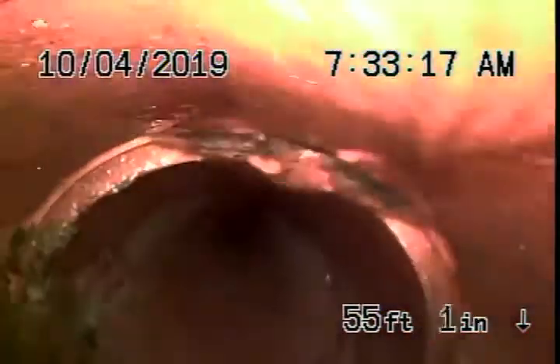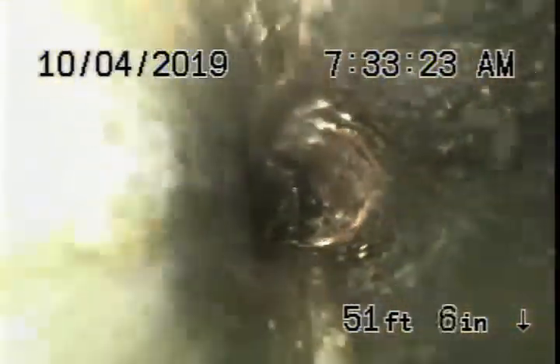So we're in the six-inch clay pipe. Looks very good condition. We've got a little bit of water running in the house — it's nice and clean in the line. Then it's going to come onto the property here and it's changing to a four-inch ABS plastic pipe. That's all in good condition. Whatever we've been able to check all looks good — nice and clean the whole line. You can see the water's running very well.